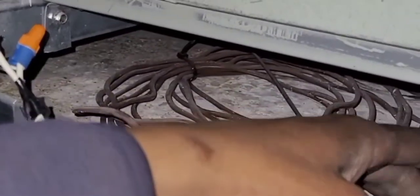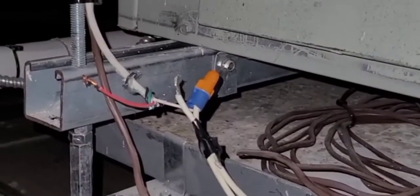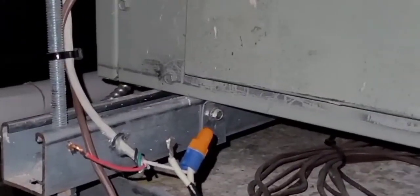I saw the wires hooked up to S1 and S2. The first thing I did — since I already knew I had 24 volts coming down to my thermostat — was go straight to this, located it in the ceiling, disconnected my wires, and tested continuity between the two wires going to the safety switch. I had no continuity. I freed it up and now I have continuity, so now my 24 volts should be flowing right through this switch. I'll holler back when I'm on the roof.